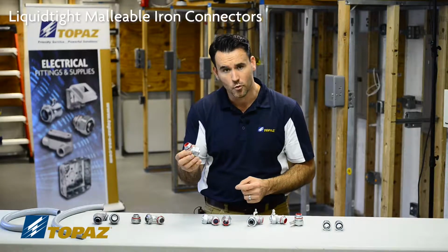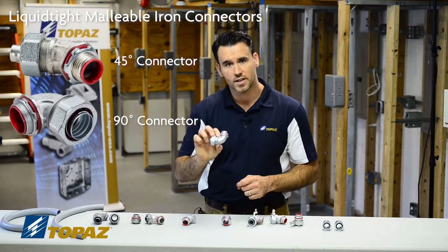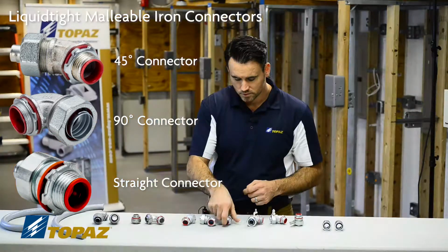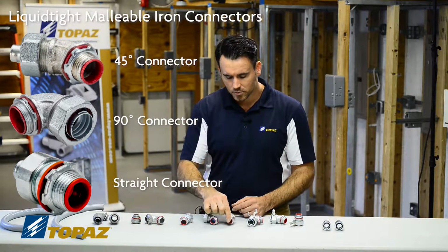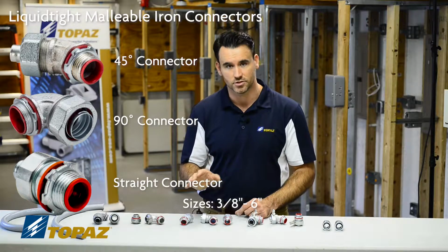We have here a 45-degree angle connector. We have a 90-degree connector. And we also have a straight. Now, all three of these connectors, based on the job you're doing, you choose the fitting that works best for you. The malleable iron connectors come in sizes 3/8 up to 6 inches.